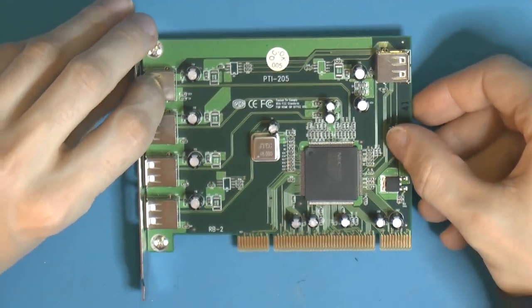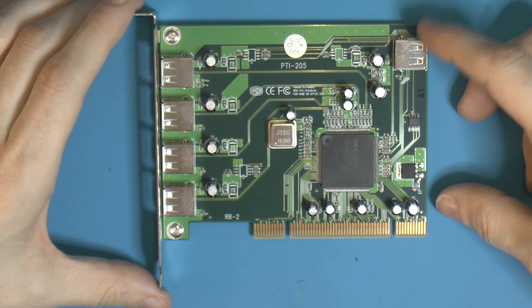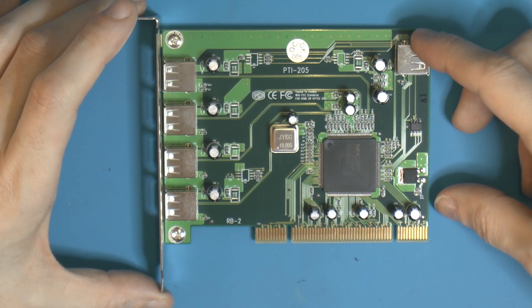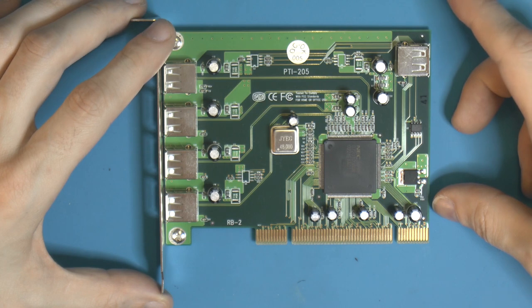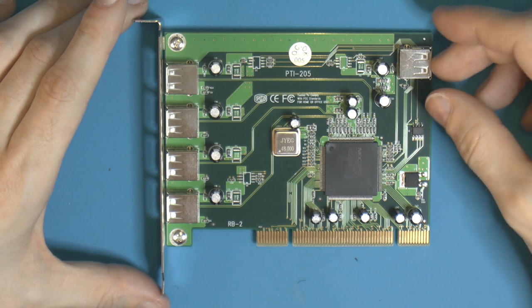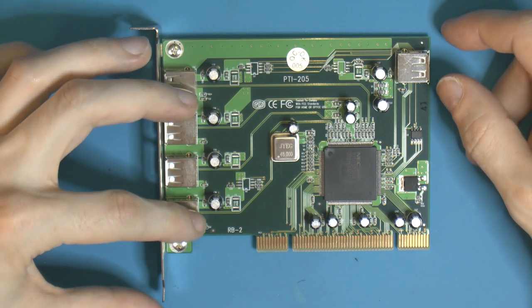And I'm thinking of adding this NEC USB 2.0 controller card, mainly because we have two USB ports on the back, which is not a lot. I tend to need about three when I take my computer to a LAN party, depending on what mouse, keyboard and speakers are used. My speakers are usually USB powered, so when I only had two ports I had to plug them into a phone charger. And also having the 2.0 speed is kind of nice if you want to use something external.